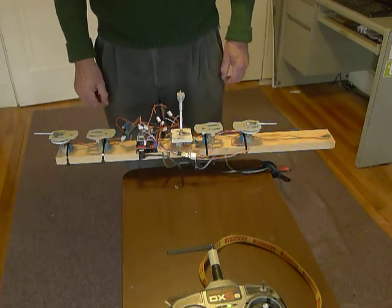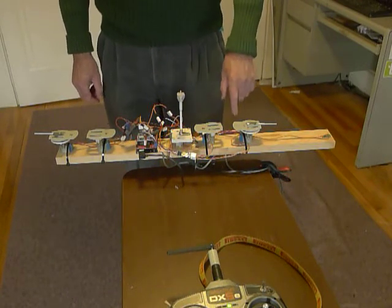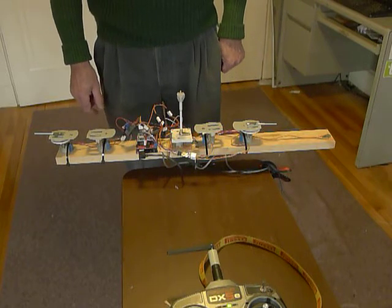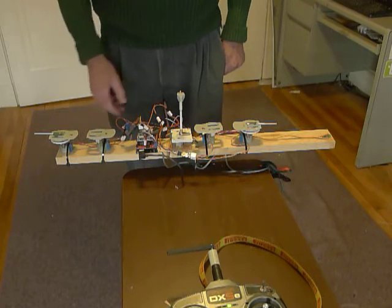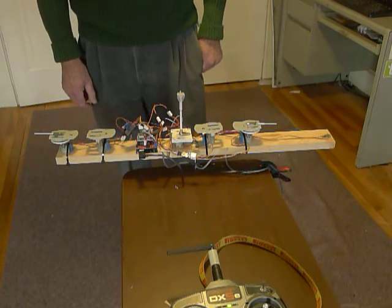This is the RC receiver. The stepper motors have been converted to be bipolar from their original unipolar configuration, because this is convenient using this particular CNC driver shield.